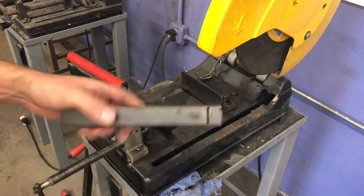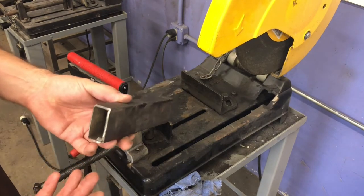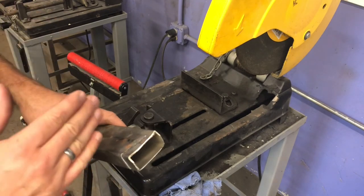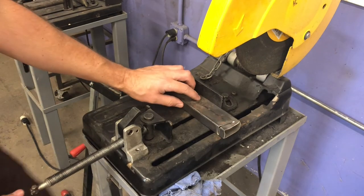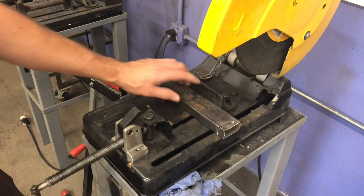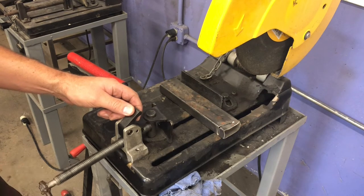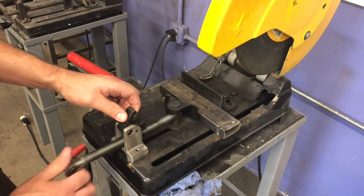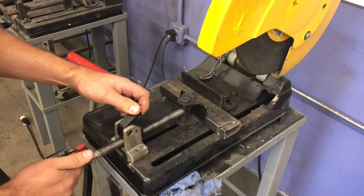This is a good example of something you might want to cut on one of these abrasive saws — a hollow steel tube. You couldn't cut it in any of the brakes because it would just squash it. Now, you're going to want to clamp it; you don't really want to hold it because it throws so many sparks. These saws have a threaded clamp, but you can lift the lever up and then it slides in and out — when you put it down you tighten it up, which is a lot faster.